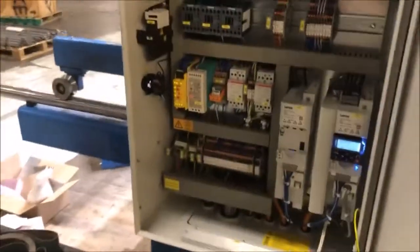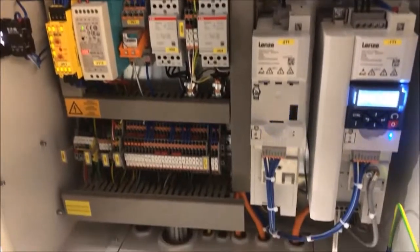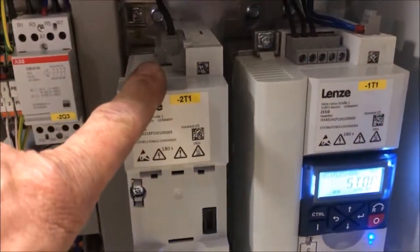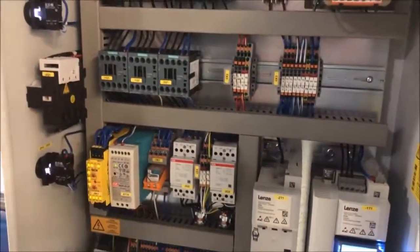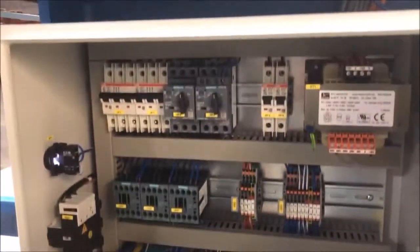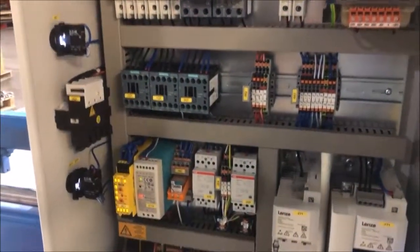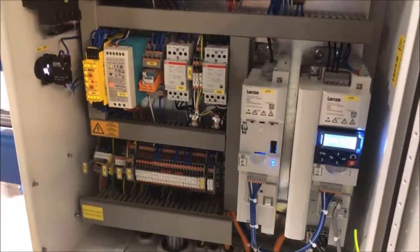Let me give you an impression of the electrical cabinet. It's an extremely clean, simple solution. You have your incoming power on the main switch, your vacuum switch, and your main power indicator light. Then you have the small inverter for the table up and down, the big inverter for the belt speed so that you can control that up and down. You have a safety relay, a 24-volt wide-range power supply, a couple of breakers, overload switches, a transformer for the lights, a couple of contactors and timers. On the bottom are your connecting points — this is where the main power connects from the outside.